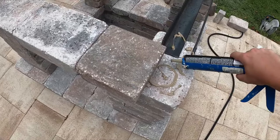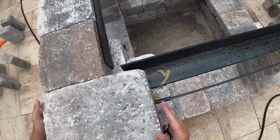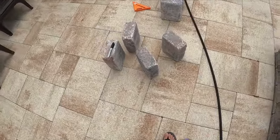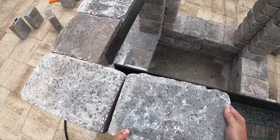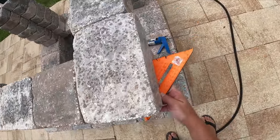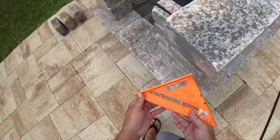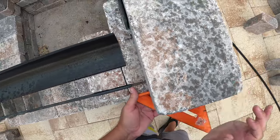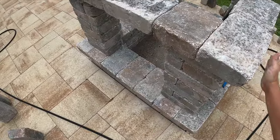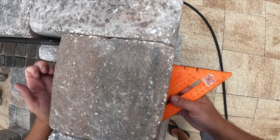Chances are I'm going to have to bail because it's starting to rain. The layer is in — it's glued. Working with stone in general, you can try as much as you can to stay level but there are always going to be some ups and downs. I tried to compensate by taking them out with grinding. Reality is I'm pretty damn level from the ground up, but as you can see we've got close to a quarter-inch slope toward this edge, and it's just going to compound by layer.